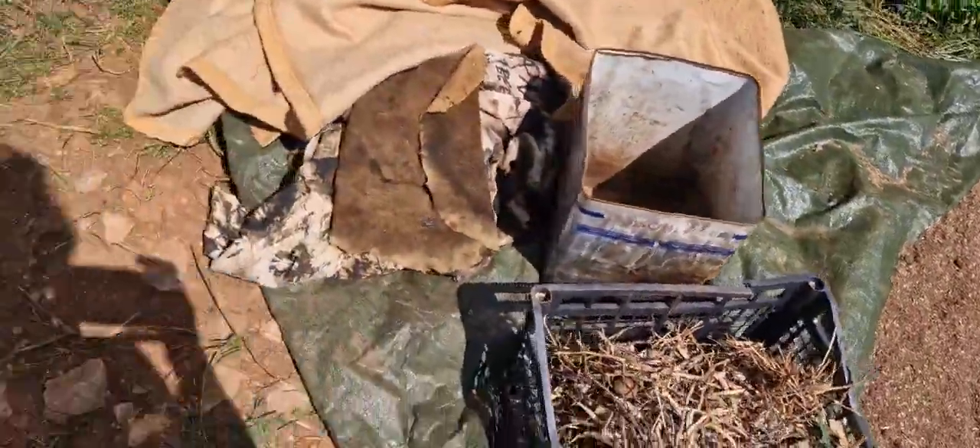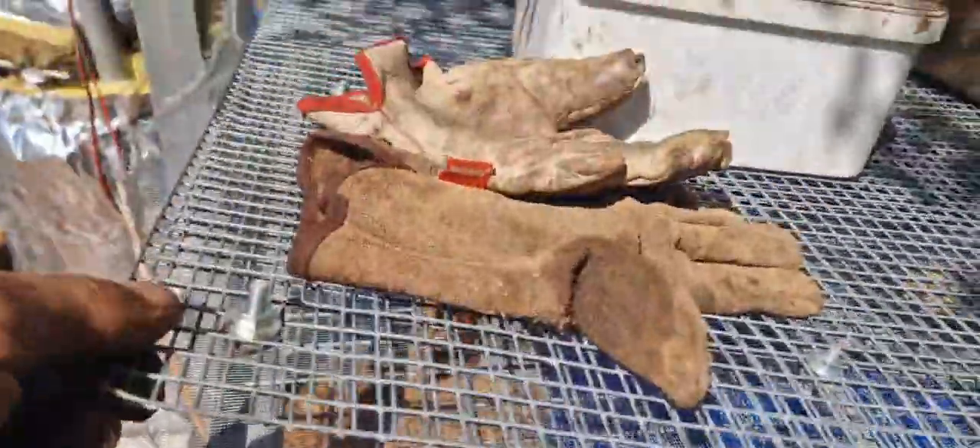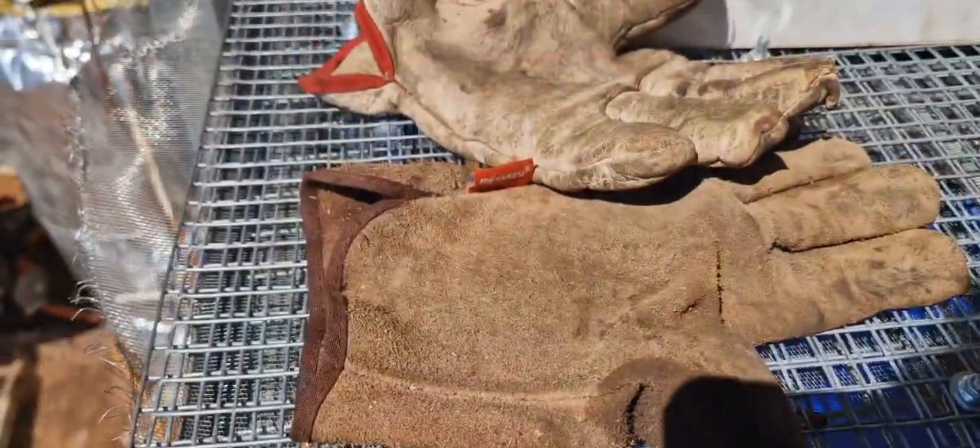Here's the output — the long sticks and the dust. I use this shaker table with different grades. The one-inch grade I use to separate the longer pieces, and for the other gasifier I need to sieve out the smaller pieces as well. With this mosquito mesh I sieve out the dust, which makes — how do you call it — clinkers underneath the gasifier.